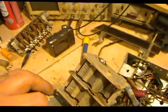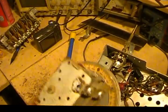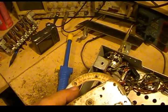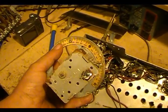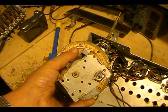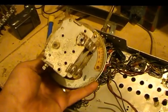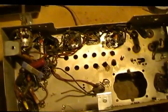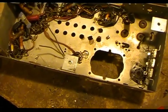The tuning condenser needs cleaning, though not too bad — I've had a lot worse. The numbers on the back are so that you don't have to worry about the dial when you're doing your alignment. When this is in place, there'll be a pointer, or something in the instructions that tells you how to set one up so you can follow this little chart instead of looking at the dial, being that the main part of the dial, or at least the number parts, are inside the cabinet.